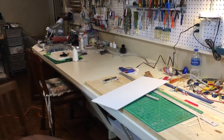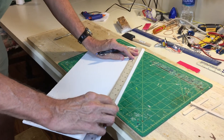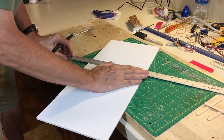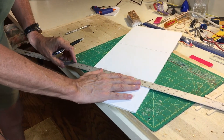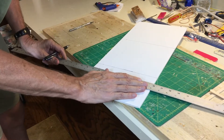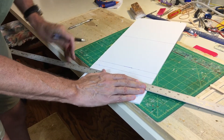You can make the width of the wing any size you want. In this example, I'm going to do a 7-inch chord, or width of the wing. So I measure off 7 inches along here, and then about 7.5 inches down here, just to have a little bit of extra for the trailing edge. You simply draw the line for the 7-inch mark, and then the back of the wing is this line right here. We're also going to take two 1-inch spars and cut those out now as well.